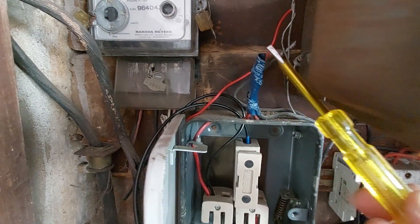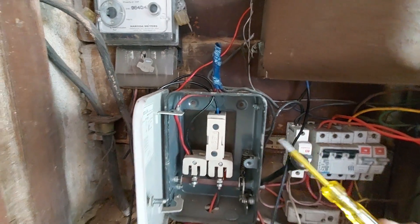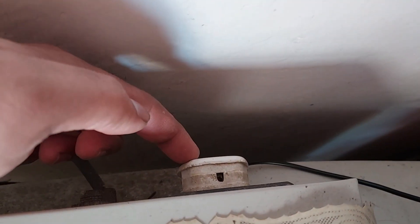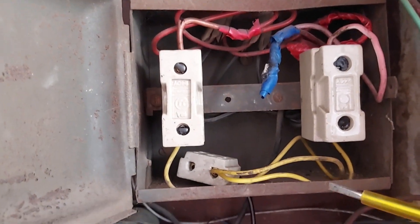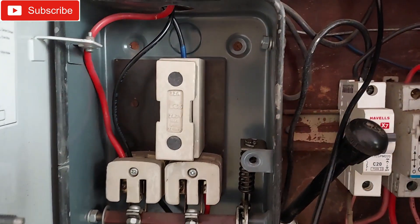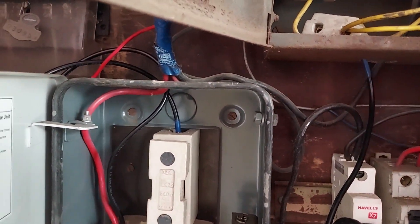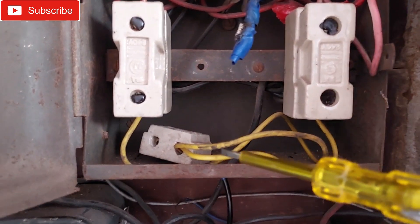This is connected here — you can see it's all taped up. Now you just need the phase line for the output. That's the output plug right here to the inverter, and you can see just one wire — this black wire — that's the phase. Connect the phase line to the right side of this plug, going out to this main connection and to the household line. The household line was coming from this fuse to this other fuse box. I removed the original red wire from the main fuse box and replaced it with the output wire coming from the inverter output, which is connected right here.